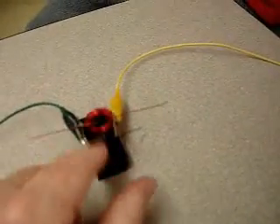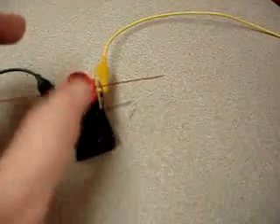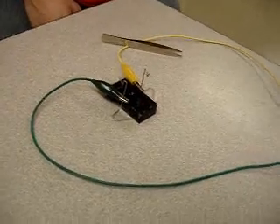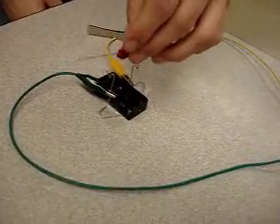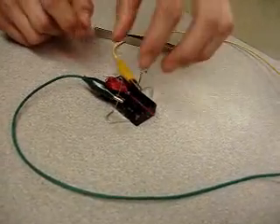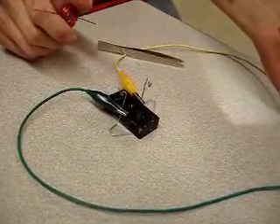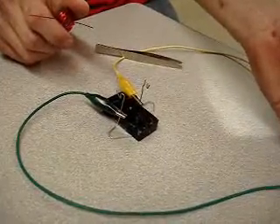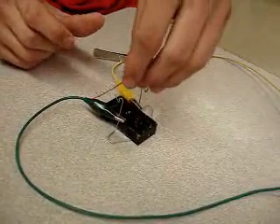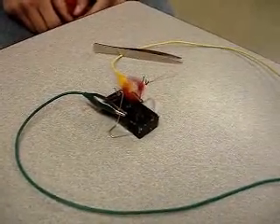I don't think there's enough juice in it. We don't have anything yet — let's see if we can get it going. We've played with it a little bit and I think we're ready to run it. I'm going to spin it. Whoa — we're going to need to reduce down the volts. It was running a little too fast and it jumped off its cradle. We're going to reduce it down to six; it was at 22. Go ahead and try it with six volts. Oh yeah, there it is! Awesome. Nice. Running beautifully.